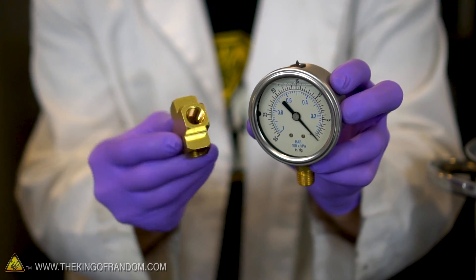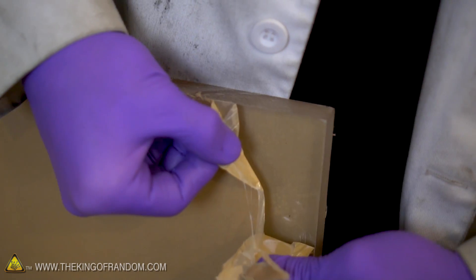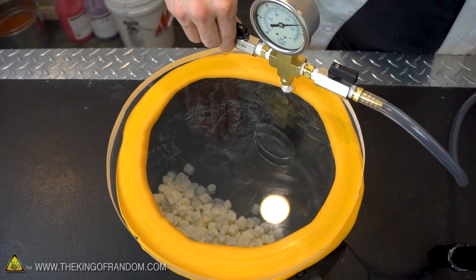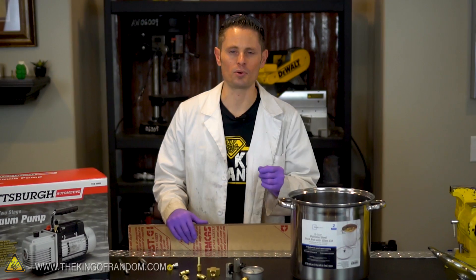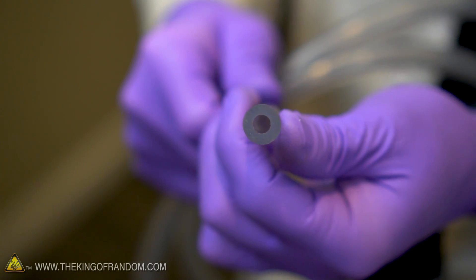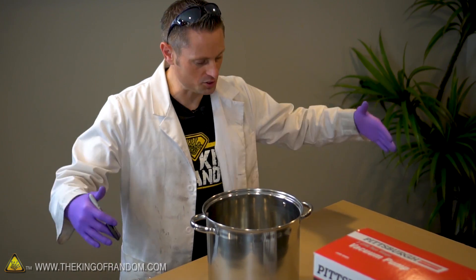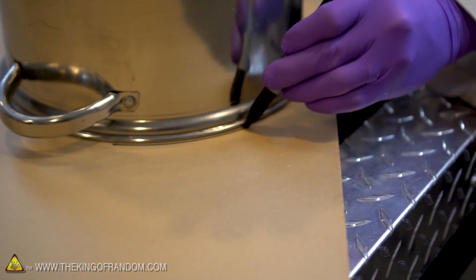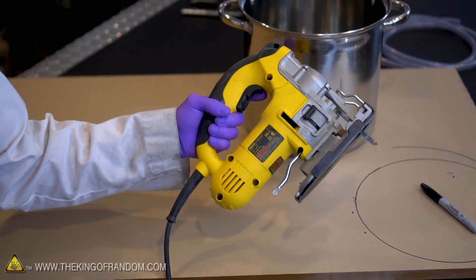Just for fun I picked up a liquid filled vacuum gauge as well. This isn't really necessary — it's just gonna show us what pressures we're pulling inside the vacuum. For our lid I'm using some three-quarter inch crystal clear acrylic so we can look down inside the chamber and see what's going on. Now acrylic is pretty brittle and under vacuum pressure it can implode, but three-quarters of an inch thick should give it enough integrity to hold up. I'm also using some clear poly tubing with really thick walls so when we pull a vacuum it won't collapse. This sheet of acrylic probably cost about $100, but all we need is a section just bigger than the mouth of the pot, so we'll flip it over, trace around the edges leaving about a quarter to a half inch overlap, then grab a jigsaw and cut it out.